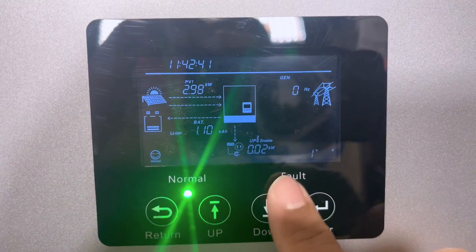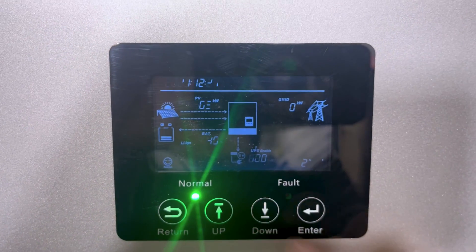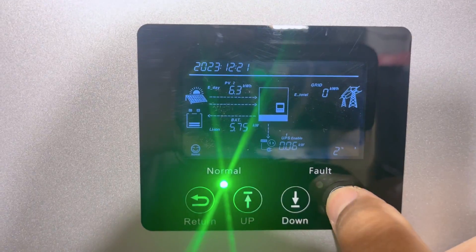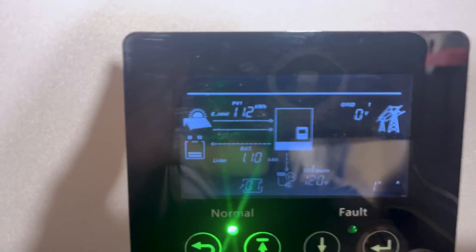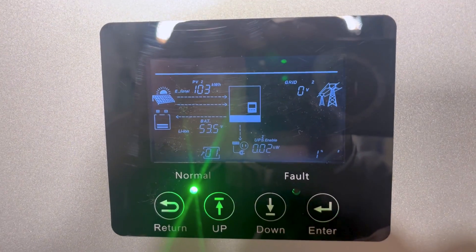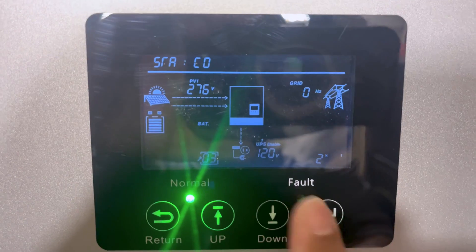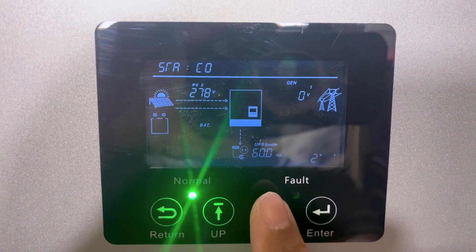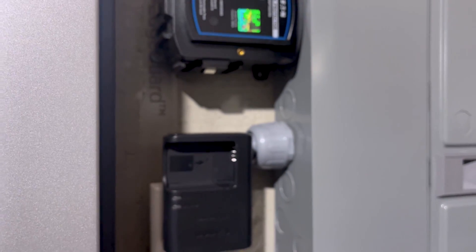See if you can see this display — that green light is blaring. Basically what we're going to do is hold Enter down for three seconds. It'll come in and have your settings pop up and it'll be blinking. We'll go up to setting three, press Enter, and instead of lithium we're going to go to no battery. Let's see what happens. Let's see if it cuts the power out. And — it cut the power off.